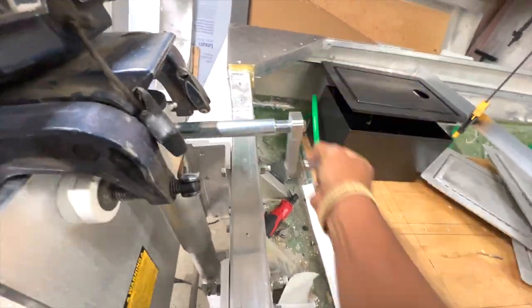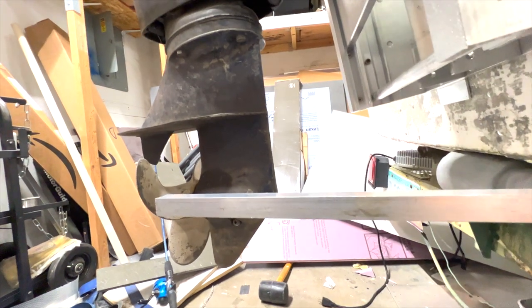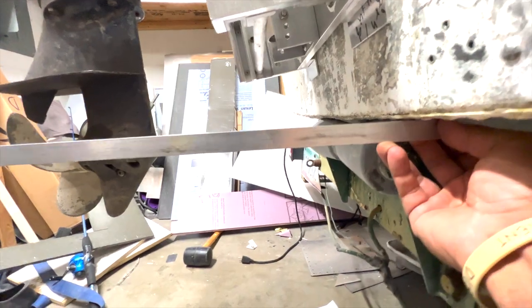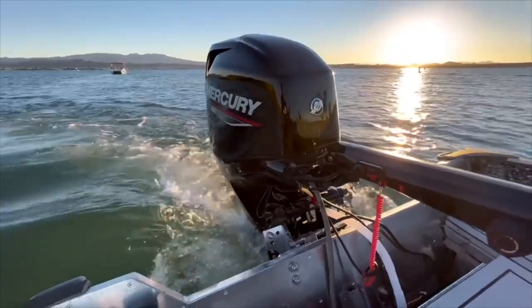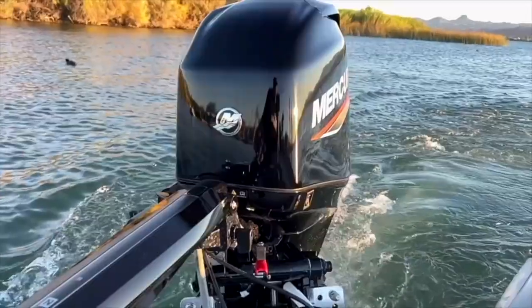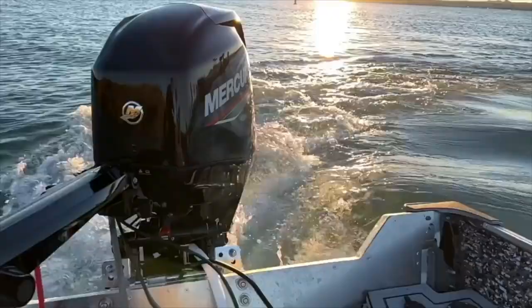The farther the motor is back, you will get on plane a little faster depending on your trim setting. The secondary purpose of a jack plate is you can crank it up all the way out of the water to where the motor is just barely sitting in the water deep enough to gather enough water for the motor to cool. That's a really good thing for people working in flats and shallows. A jack plate can also complement an ordinary outboard with power tilt to achieve max optimal speed.